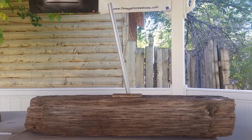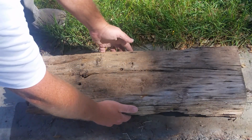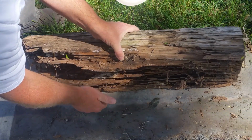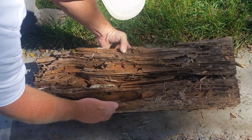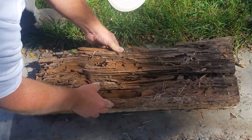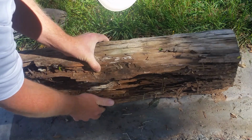Although setting a railroad tie appears to be a simpler method, we strongly recommend following our permanent stake setup method using concrete, ensuring a truly permanent setup, because wood, as shown here, may rot or become infested with insects over time, causing a need to eventually replace your setup.